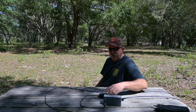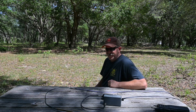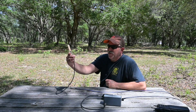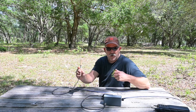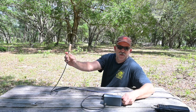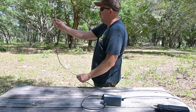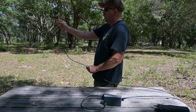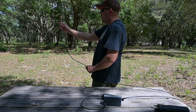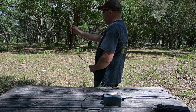Right now our attenuator is on zero. Let's turn our receiver on — you can hear the control channel signal. You can see that regardless of position of our loop antenna, our receiver is oversaturated with signal, so this isn't going to provide any direction-finding capability at all. When we apply 20 dB of attenuation, you can hear we're losing and then picking up the signal again.